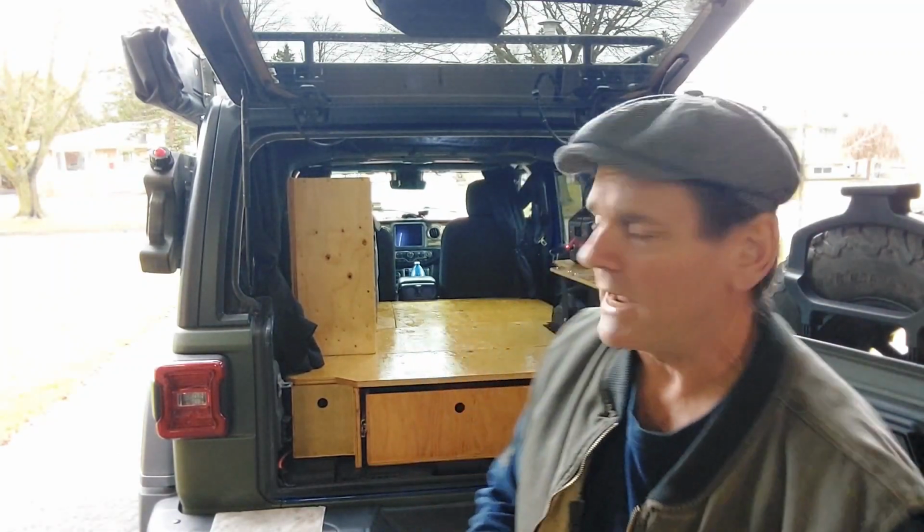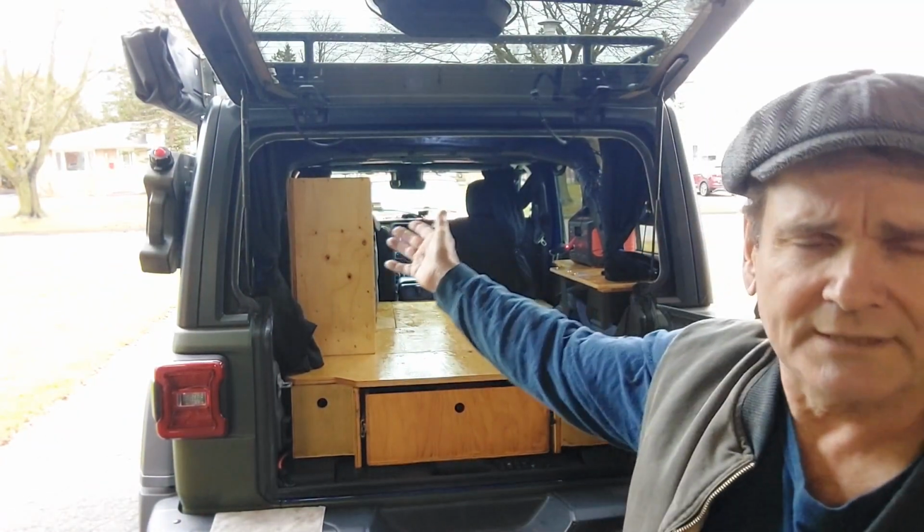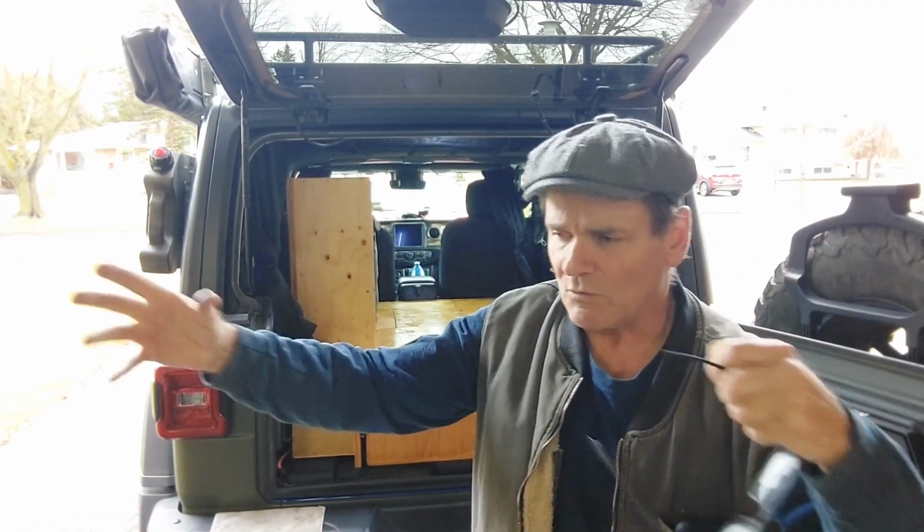to stop them from actually walking around inside the cabinet is I'm just going to cut some rubber bungs out of rubber round stock or square, probably round stock that I have, with an interference fit, and I'll just wedge them in there, and that'll keep pressure on it enough to hold it so it won't walk around inside the cabinet.